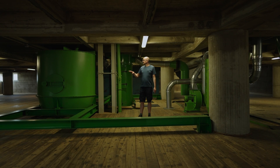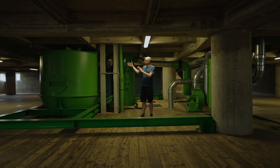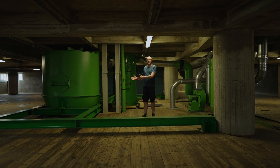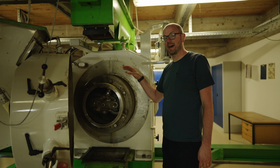On this level we have buffer or storage tanks where all the pelletized hops are held before they go down into the foil packaging in the layer below. And this is a pelletizing die — the hops are forced through the little circles and it creates the hop pellet.